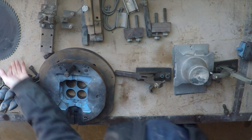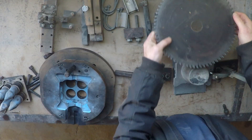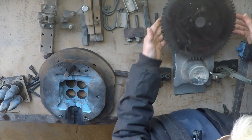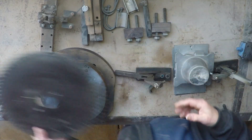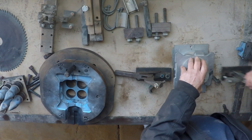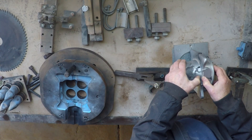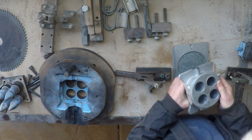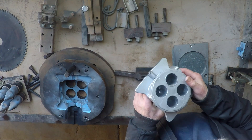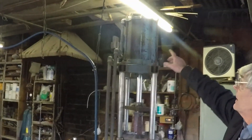And then using a large Robo blade in the milling machine, we slice it halfway through, turn the casting around and then slice it halfway through again. It's all nicely pitched so that the blade comes through about that level, which is just below the filter that's inside there. You can probably just see the filter in there. But this is the machine that they'll be done in.